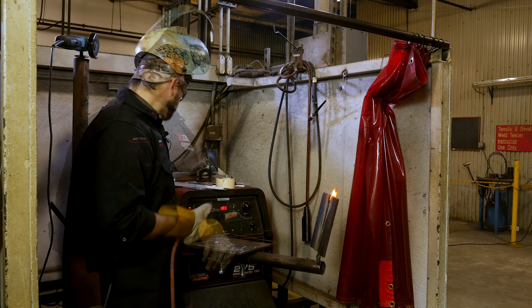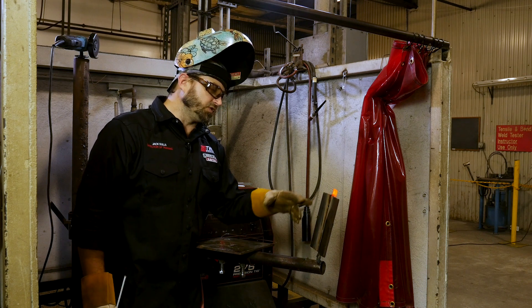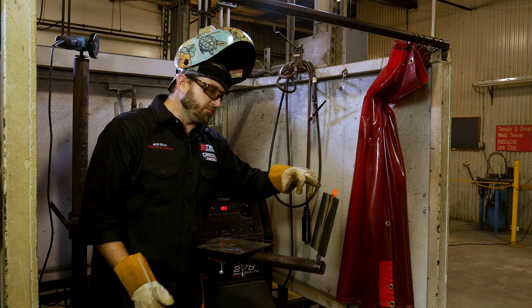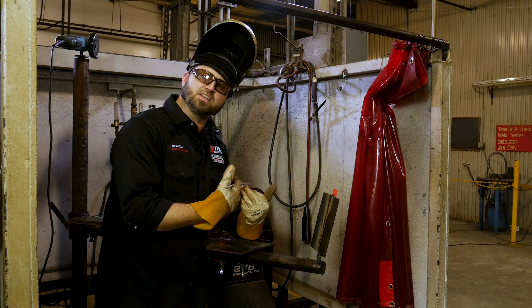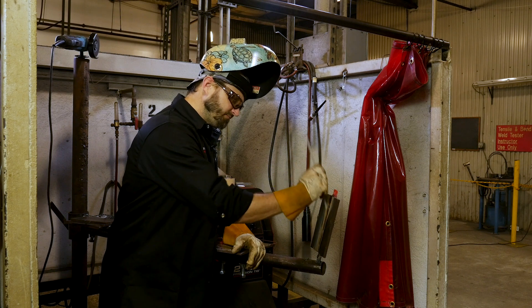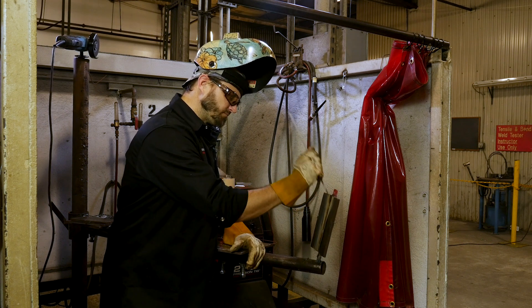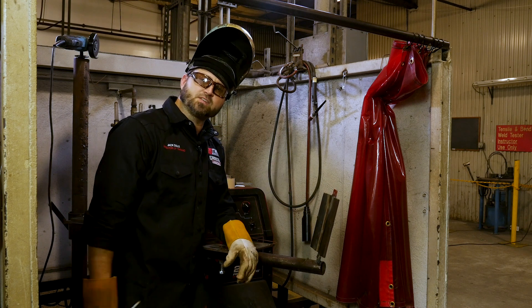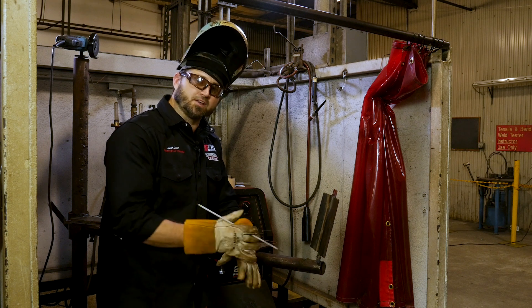Here's where you also want to use your runoff tabs. They give you the runoff tabs — use them. Start down below, build that up a little bit, run all the way up to the top and build that up a little bit, so whenever you go to put your fills and your caps in, it doesn't sink down and be underfilled in those areas. So we're going to go in and start running some more passes here. I'm going to go ahead and fill this up and cap it on out and show you how it's done.